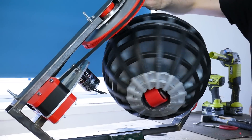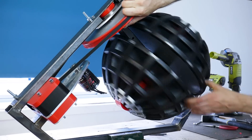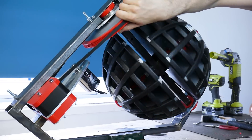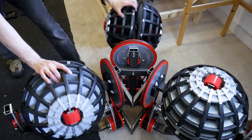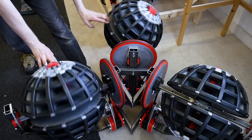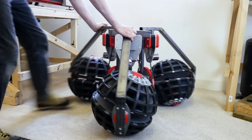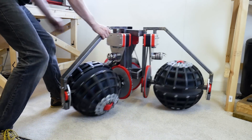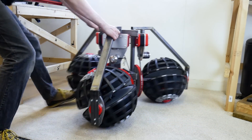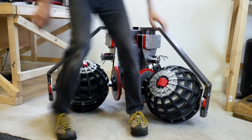This is an omnidirectional wheel so the two hemispheres can spin independently of the drive axis, meaning it can move in all directions. We can bolt all three of those to the middle triangular pieces so we've got our three wheels at 120 degrees apart. The whole thing is easily back-drivable owing to the 3 to 1 reduction, so I can push it around and check it moves in all directions — which it does pretty well — as well as being able to rotate on the spot by driving all the wheels in the same direction.